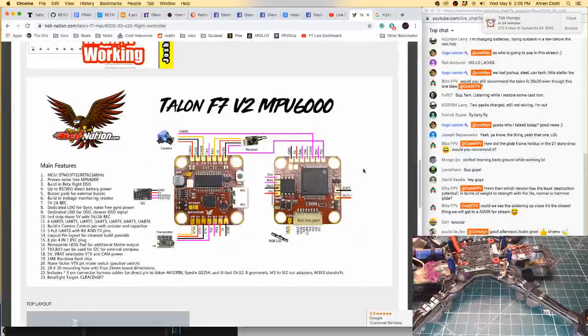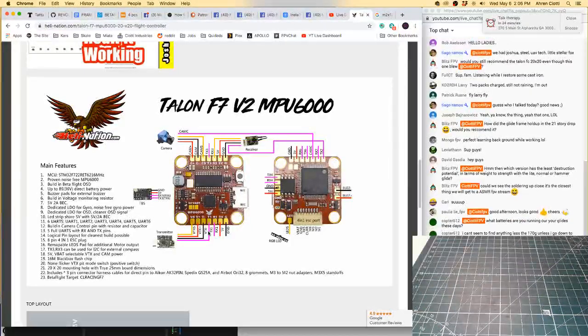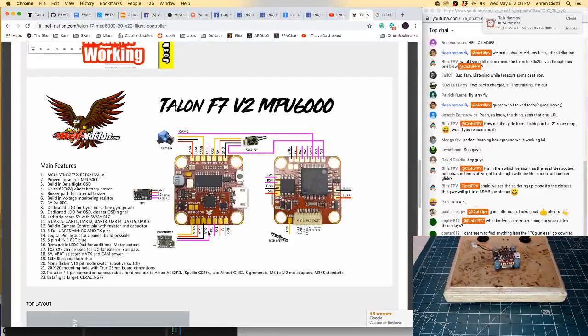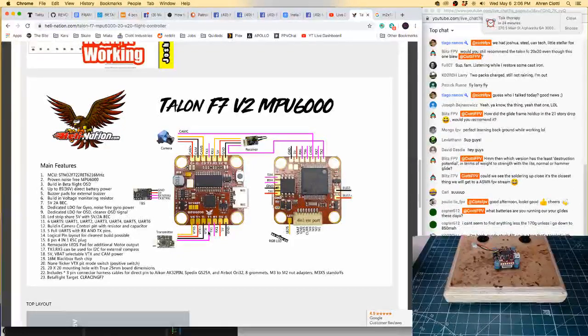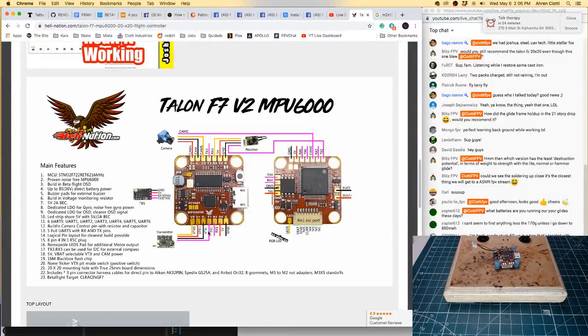Referring to the diagram, where is the VTX? There it is. Signal. Positive, negative, TX1. So it is on this side, and it's down on the bottom. So let's just tin them real quick there. We want, what did I say? Signal is all the way off on the side. Nope, that's not solder. Those are tweezers. Signal. And then, pretty sure it's this one, T1, right? Signal and then T1. That's it.